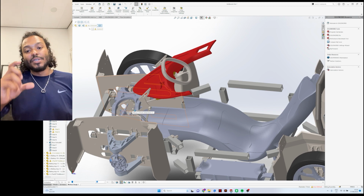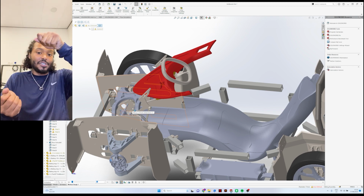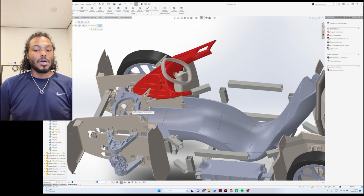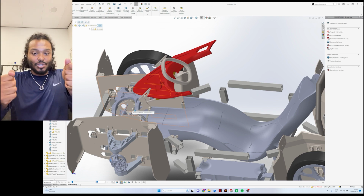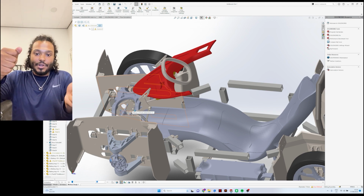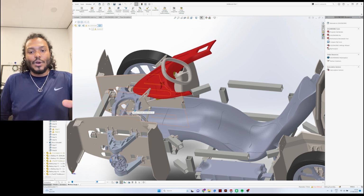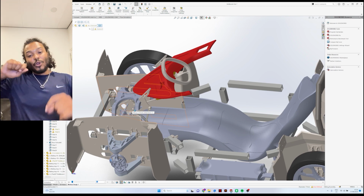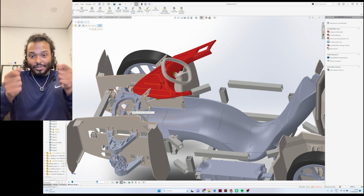So what we need to do is mount 2 rotating sensors, one that is only taking positive measures to the right and one that's taking positive measures to the left. And then also attach that to the throttle to make sure that as soon as you have a 15-degree rotational input on your steering wheel, there's a 5% power split between the left and the right wheel, if that makes sense. But we can also put that on a toggle to calibrate that for different driving modes or something.